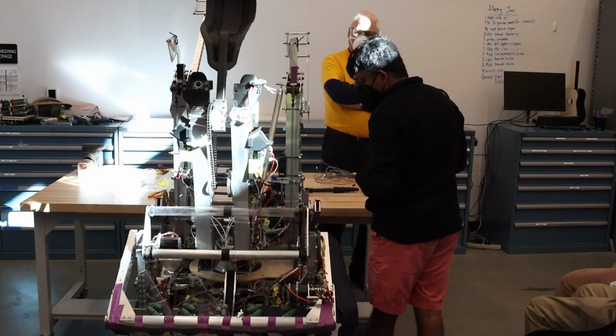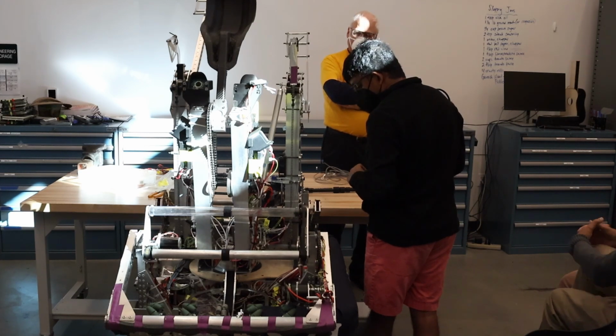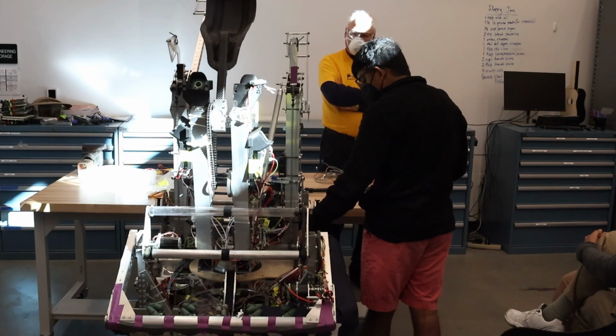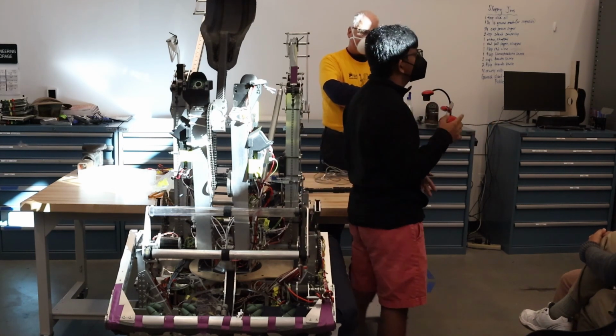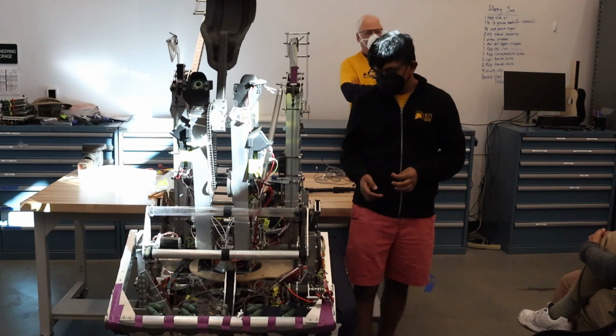And so in industry, what you would normally do is you wire up the limit switch to be normally closed, and when they open up, then you get the trigger. And so in the event the limit switch fails, then your thing doesn't work. So there's no hardware limit switch. What they were mentioning was a software limit. Yeah, it's a software limit.